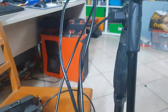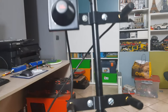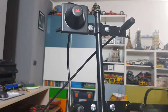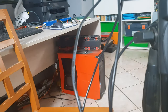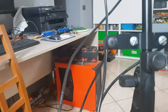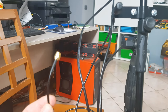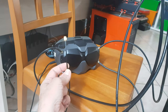Then as a second test I will use the configuration with the Sniper 2 directly connected via this cable — an RG58, one meter long, very thick — to the goggles. And then I will be swapping out that cable and instead of the one meter thick RG58 I will be using this one, which is much thinner. This is a two meter long cable, RG174, and I really think that the results will be much worse using this thin and even longer cable.